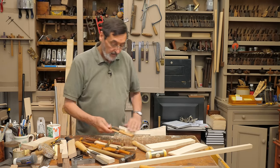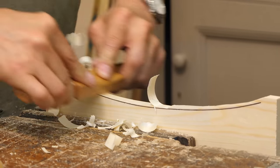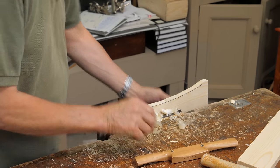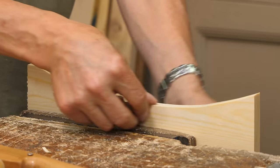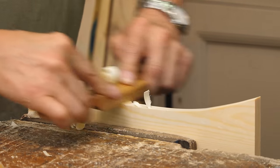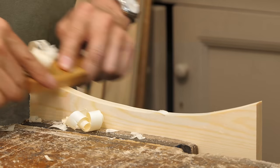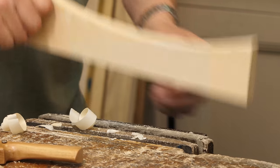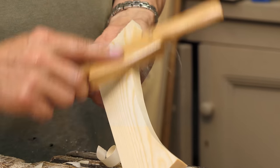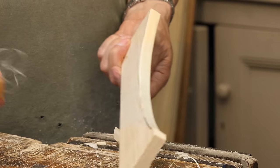Let me give you an idea of what these are particularly good at. This one I made — it's got one piece of steel, one piece of wood, four screws — and it really hits the spot. I've got a beautiful smooth result here, so this would take care of your band saw marks and your sanding marks. Look how it works — almost zero friction when you're using this spokeshave. You end up with a perfect result. If you want to take the arris off, you take it off simple like this. So exciting, so simple.